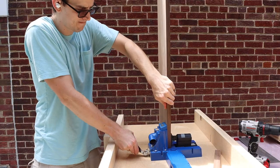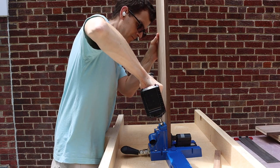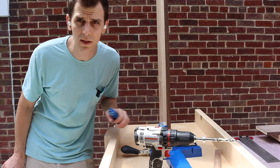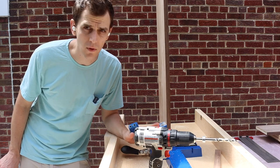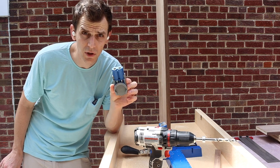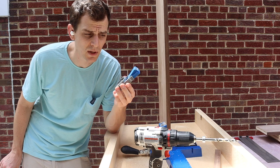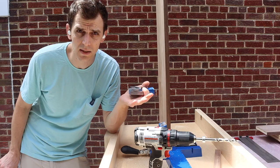I used pocket holes for a couple of different pieces that I wanted to be able to remove later. All right, so I'm using this bigger Kreg pocket hole jig to drill all my pocket holes for the back and the bottom of the insert. However, you can definitely use the smaller version, which I also have and have used extensively. I'll link it in the description below. It works just as well, just not quite as fast.